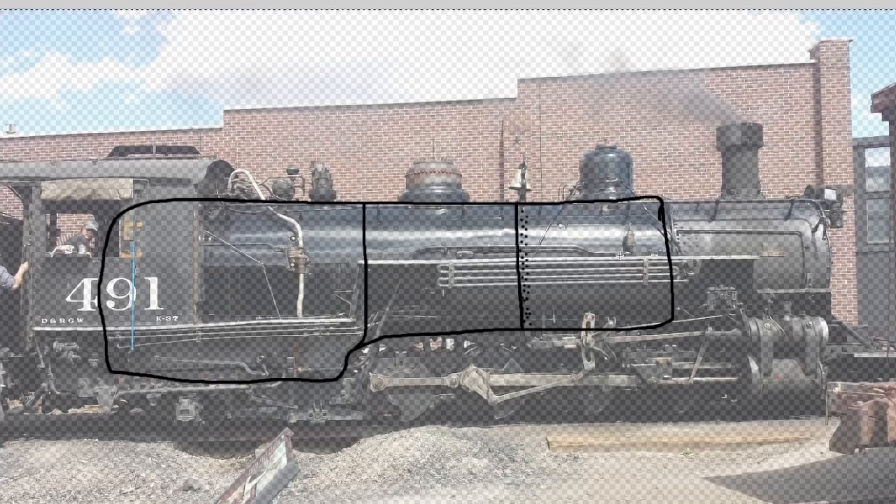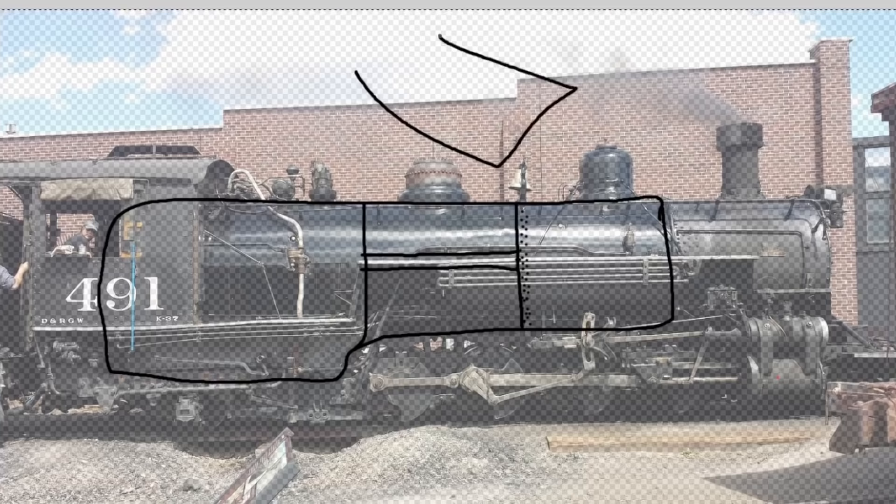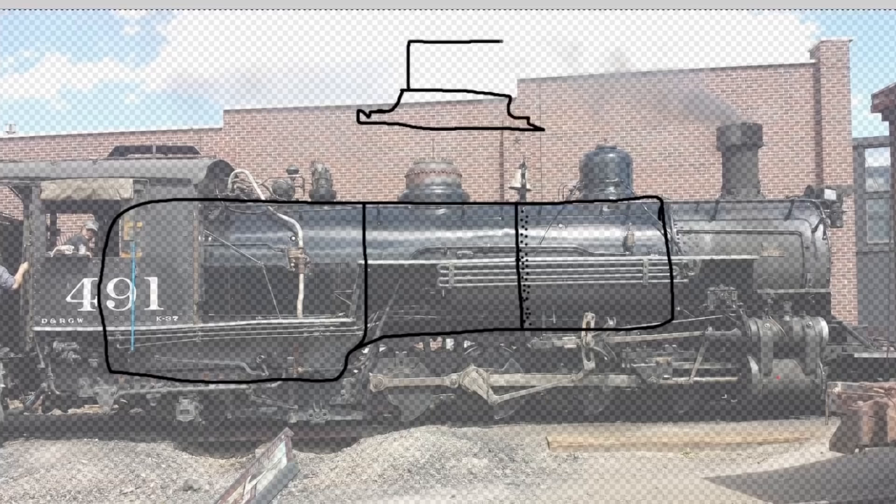To seal a single course, you have what is called a butt seam — joining the two ends of the rolled piece. You put a second piece on the outside/inside and add extra rivets along it, typically with an internal diamond-shaped doubler to help distribute stresses. The steam dome is part of the boiler — it's made of about three or four pieces: a shoulder that transitions to the boiler, the side wall, another shoulder to go to the top, a hole inside so you can get in through the steam dome to perform maintenance, and a lid held down with studs and bolts.